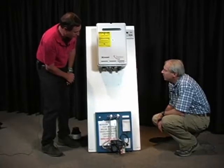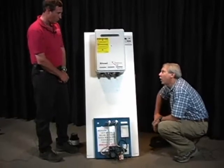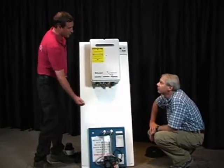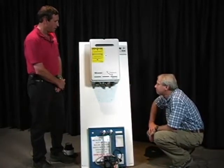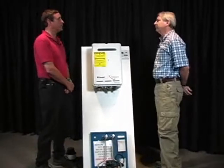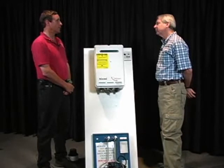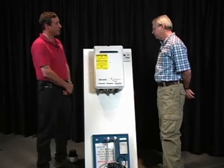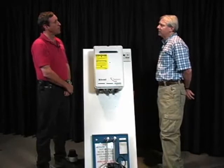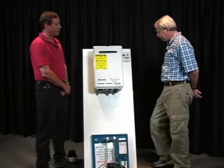the wind chill factors. Is that box something inspectors can typically open easily to take a look inside? Usually there are just a couple of screws at the bottom of the box and you pull the plate off and you can look inside. The other thing we recommend, and most of the manufacturers recommend, is a battery backup, so that in the case of a power outage, the unit has a way to protect itself from freezing. So in cold climates, the insulation alone really isn't enough to keep the pipes from freezing. Right, exactly. So you have to be conscious of that.